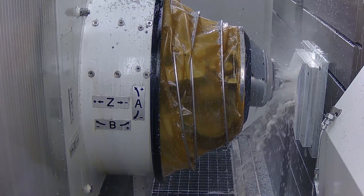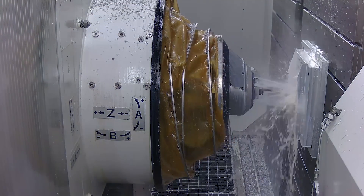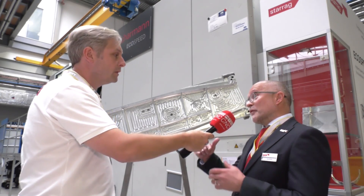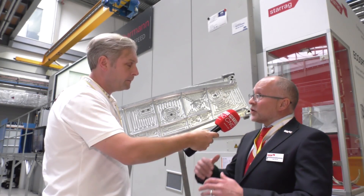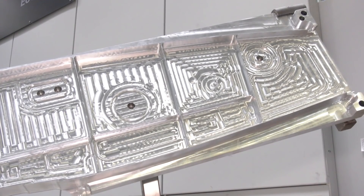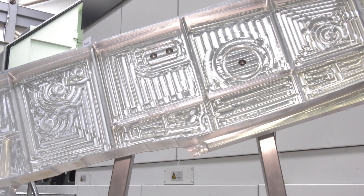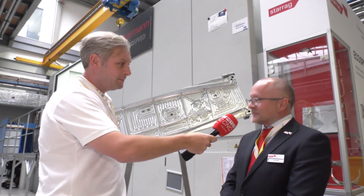So is that why you're working closely with Kyocera SGS? It's about a very safe, stable process that's got to be the fastest in class — very high performance roughing and very high speed finishing, where we've got very dynamic machines that can machine five-axis pockets and corners very quickly. This component behind us has around a 40 minute cycle time, and it's a typical component that you'd machine on these machines. Great example of the efficiencies you can provide.